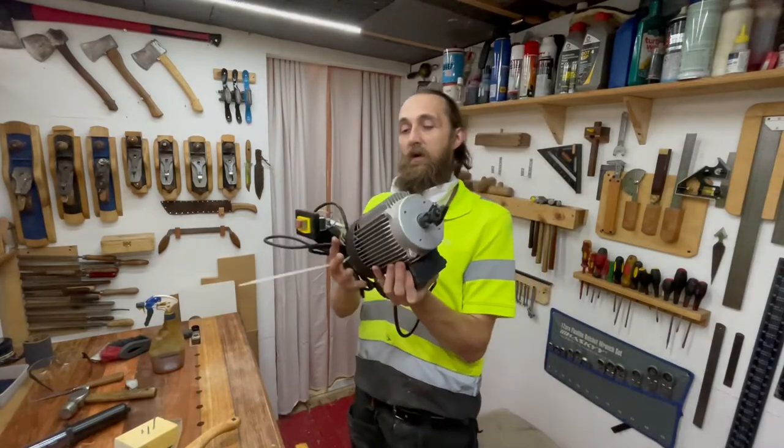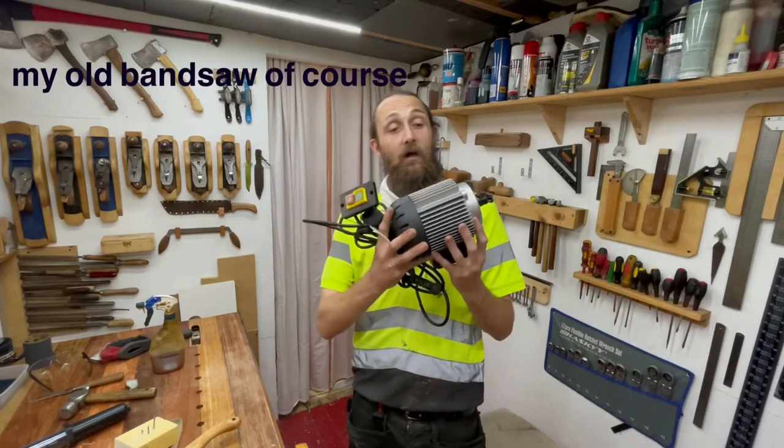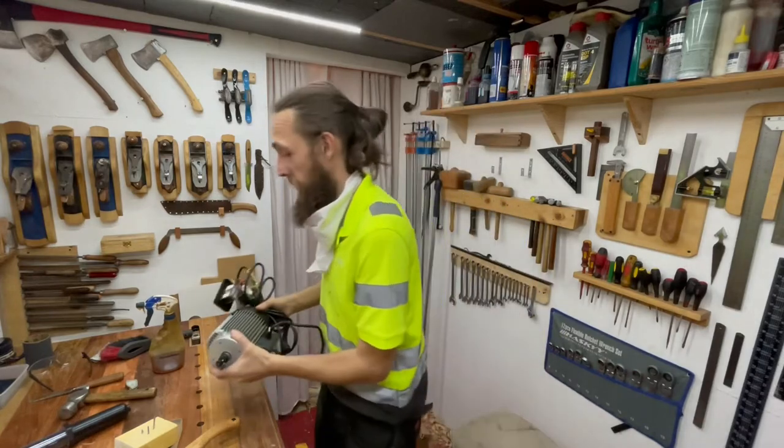It would be beneficial to have a 1x42 or something, but I could make it so the wheels are adjustable, so I could make it 2x42, but then change the contact wheel to a 1x42, and I can make the table so the plate itself is adjustable, so you could potentially have a lot bigger sander. I took my motor off my bandsaw, so I've got that, and I've got the switch, so the power side is sorted. It is just about designing the actual frame and the wheels, and then getting building it. That's something that's really cool to have and important when you're trying to sand certain profiles and shapes, for making certain parts for the marble machine.